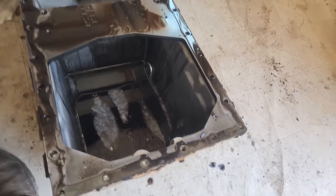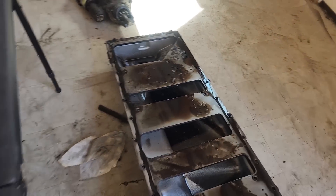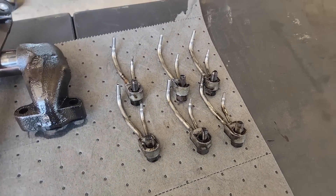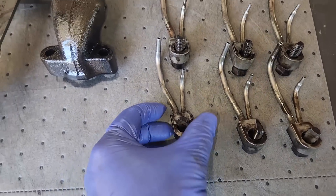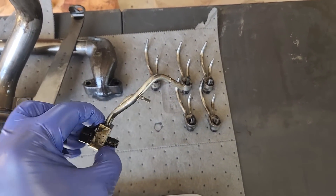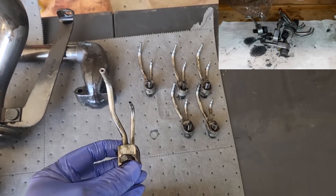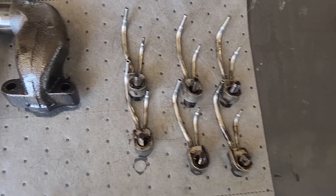We're getting back to working on the C18. One of the common questions I get is what are the differences between a C18 and a C15. One difference is the block stiffener plate on a C18 is more similar to the 3406B style — it's a full width block stiffener or ladder plate that goes between the oil pan and the block. The cooling jets are also a big difference — they're much larger and wider on the C18. The C15 style nozzles are pretty close together but use the same style retaining bolt, that kind of half bolt.